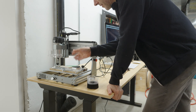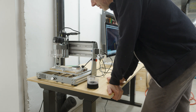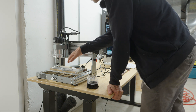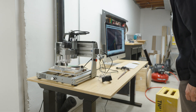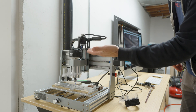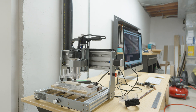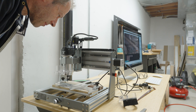I set up a new file, erased everything else, and I'm just cutting the pocket again. I'm going to make it half a millimeter bigger and keep expanding it slowly until we get the fit we want. Everything's still zeroed, everything's still good. Since it's doing hardly anything at all, I'm going to run it without dust collection. After it finishes I'll go in and examine the fit — might do another half mil because we don't want a pressure fit.